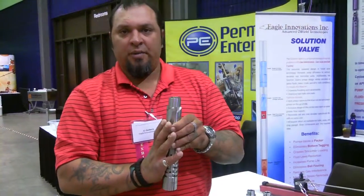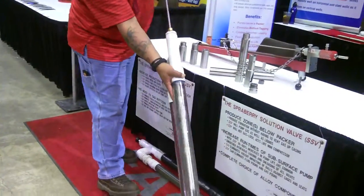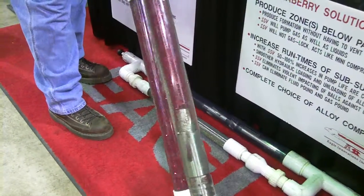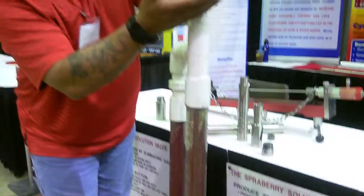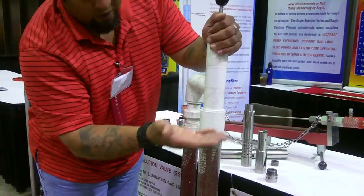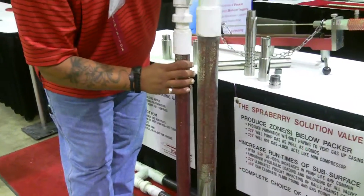So what all this is doing is fluid management — we're keeping all your solids, your damaging solids, off of your plunger and maintaining your lift, prolonging your pump life. I can demonstrate this right here. You can see all these particulates in here — this will actually clean itself out. When this is at rest, we use your sand check valve rod guide, so all the particulates, all your sand and trash above your pump stays above your pump, and whatever's on the inside of your pump is re-diverted back down into your ID. So it doesn't matter where the horse's head stops — your first stroke is always going to be a clean stroke, and you're not going to have that damage.